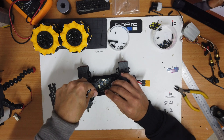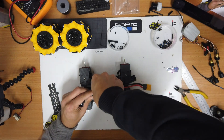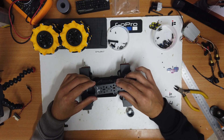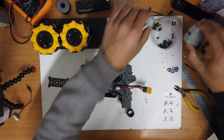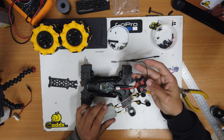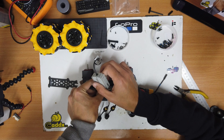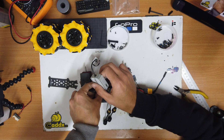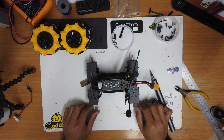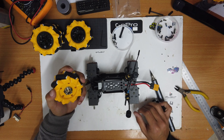The TPU parts have a standard hole to go to the standoff and one which has a place to put a nut in. The standard hole goes to the standoff on the front side of the car, and the nut goes in the back. When we take the top plate, those two screw holes can be used with the nuts in the TPU. Now let's take the DJI air unit — I've already placed my receiver inside the TPU part. The last thing is to plug everything into the flight controller: one plug for the air unit and one for the receiver, then place everything in its own place.